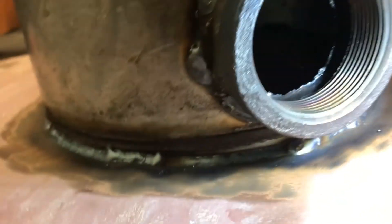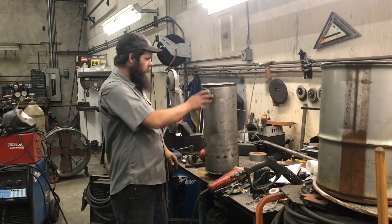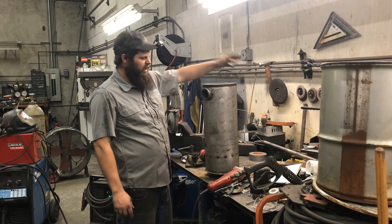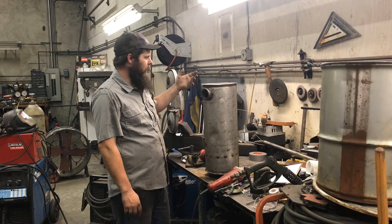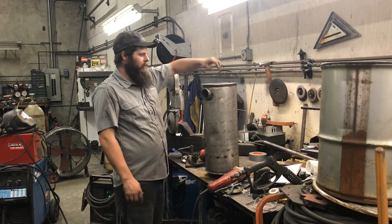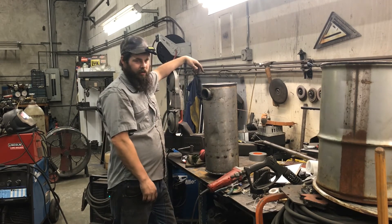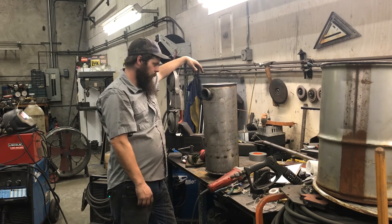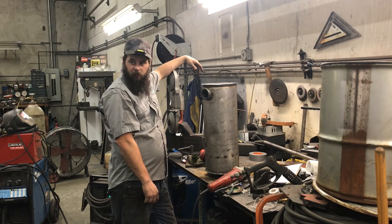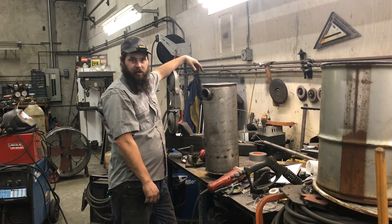You can see the water in it — no leaks. So now we'll get that excess cut off. There's the finished heat exchanger: threads welded on, cap on, water tested. Cuts don't have to be pretty — it's not going to matter. Both of them I've done now — I've noticed when they get welded they get a little hump right here, which is totally fine because that's going to help shed some ash off the top. You will get ash or soot that piles up on top that needs to be washed off periodically, so if it's got a little bit of a slope it's going to help you go a little longer between clean-outs. That's ready to go back in. Starting to run out of material — I'll see you guys in the next episode, thanks for watching.